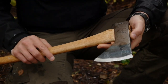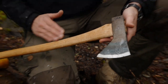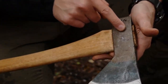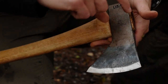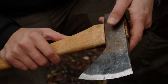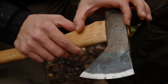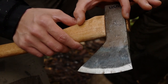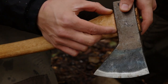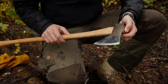The only thing I'm going to say as a downside is just with this head shape - generally with the fact that we have a small amount of purchase of the metal here on the handle in terms of this distance, it's going to affect how much it's holding and how easy it's going to be to remove that with time. If you have a long head with a long eye, you'd have a lot more purchase. But what compensates that is the fact that this handle is pretty tall this way and it's not skinny in the vertical height. So that's really good.